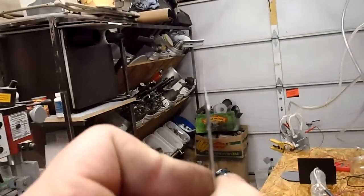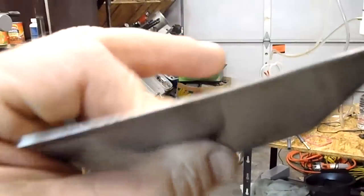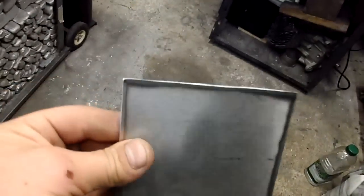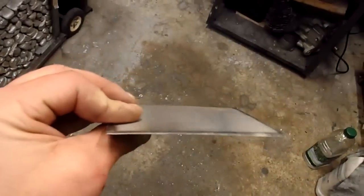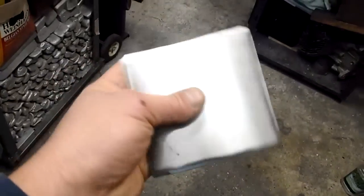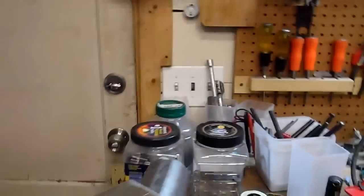If I can get that in there, and if it pops back and forth, it's because it's stretched unevenly. For some reason when it was cut, the edges heated and then shrunk, making the center expand more than the edges. So now it pops. So a quick way to solve this, and hopefully this will help somebody, because I didn't realize this at first. My first attempts came out like crap, so I had very wavy edges. But what I do, put it here, see if I can do this all at once.